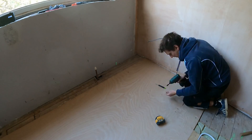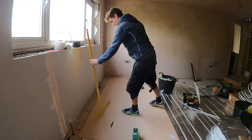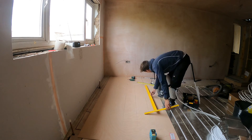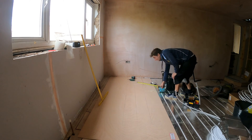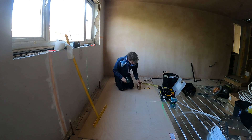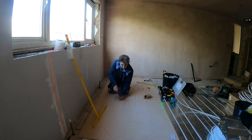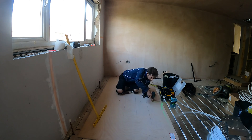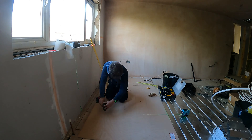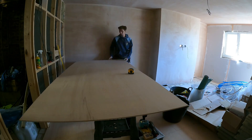When I laid the chipboard floor in, I already knew what dangers were there, so I marked on the chipboard floor previously if there was a cable relatively close that hadn't been put through the joists correctly — just to give me as much protection going forward. The pipe runs are actually 20 centimetres apart, so that gives you a bit of a guide. I shot laser levels all over — what might look like overkill — because my joist system isn't straight, making it hard to work off right angles to hit joists and miss pipework.